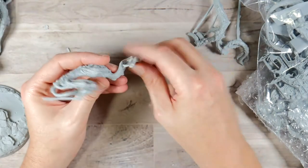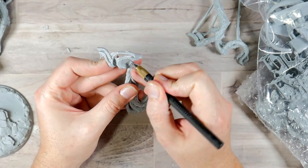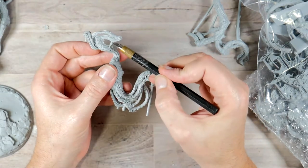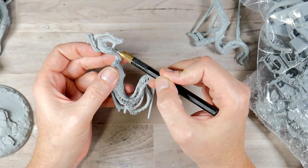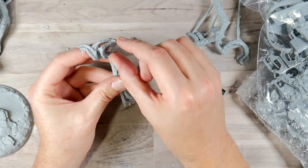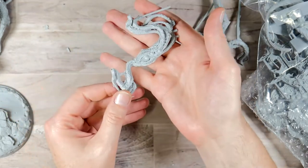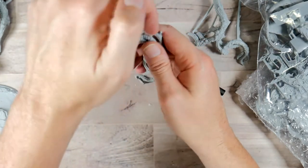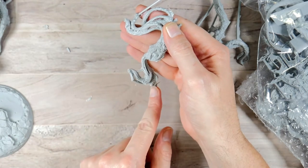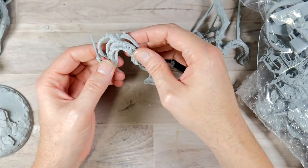Again, over here, you do end up with some little spots like these when they've printed them. I'll cut this out so you guys can see it better. Like this piece right here, this was a support and it was probably printed with that so that it kept its shape. And there's another one right here, but that's also handy when they're molding it, so when you pour the resin in this way and you're pressure casting it, it presses all the way down to these parts here and then all the way back up. You have venting, and that's how it ends up working.